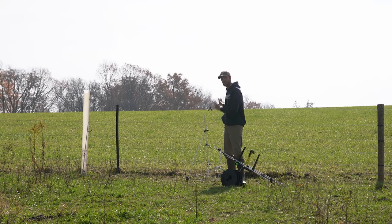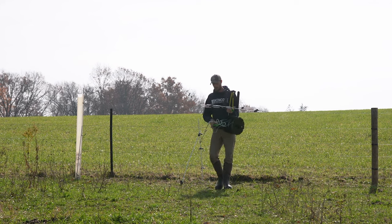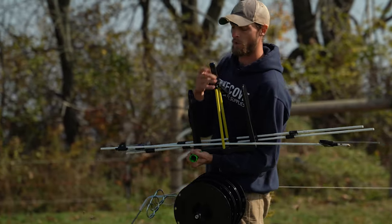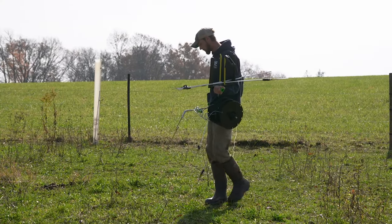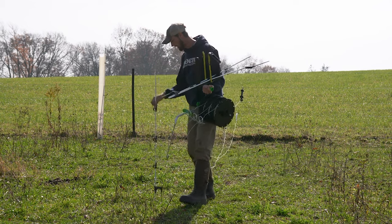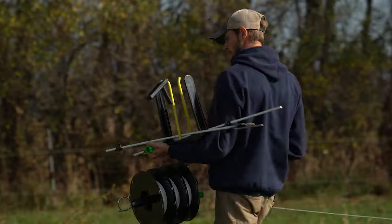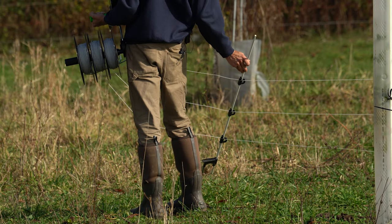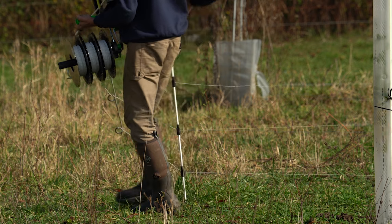The carry pack is loaded and the gate handles are attached to the fence in a sequence that matches the spools on the carry pack, so we're ready to pay out twine. Pick up your carry pack and walk straight away from the fence — as you do it's going to pull the slack right out. Unlatch the rack to access your posts. Bring the post behind you and as you push it down keep a slight angle so that the hooks of the clips can catch the twine on the way down, give it a rotation, and then plant it vertical as you step it into the ground. Then continue down the fence line.